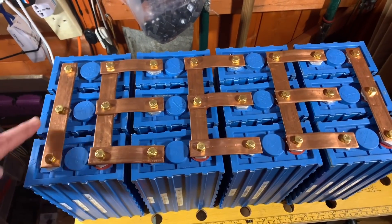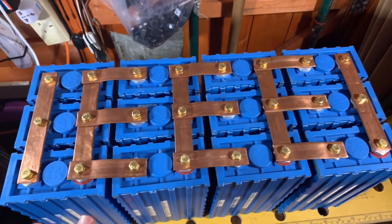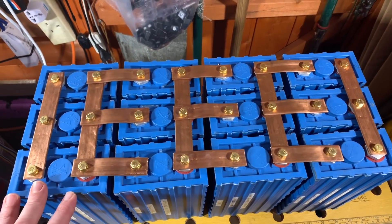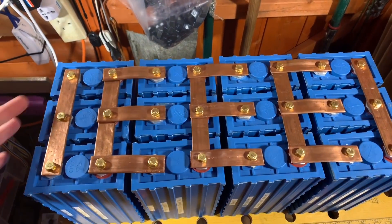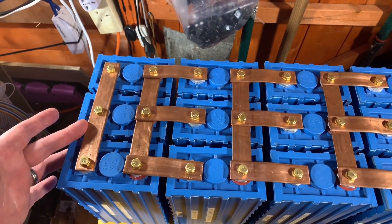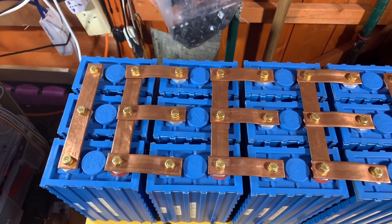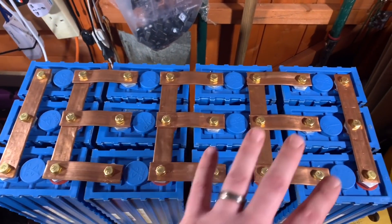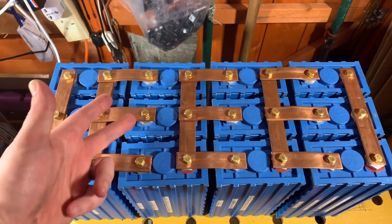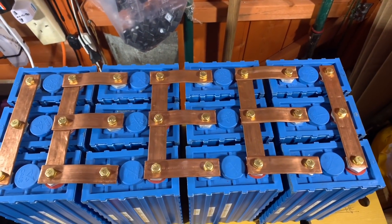This was just to check that everything worked and my measurements were correct, and the holes were in the right place — and they seem to be. I definitely need to tidy this up with some heat shrink. Originally I was going to connect all the parallel cell negatives and positives with a bus bar and then just have one strap to the next set. But recently somebody called Chris commented and said I should really do a full grid, and his argument made quite a lot of sense. So at each series connection there are three straps connecting them all together, making these rather funky, neat-looking capital E letter shapes.